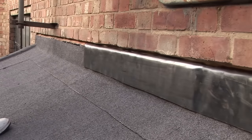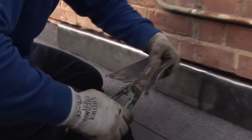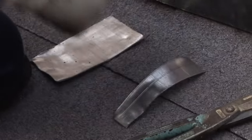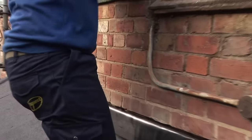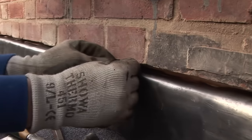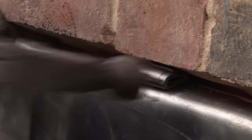I'll get a scrap piece of lead and cut an inch piece. I'll do a couple just to show you. We roll them up and they will become a lead bung. With a hammer and bolster, I'll flatten one corner so it's easier to get into the chase, and I'll push it in the wall so it stops the lead falling out. Use a hammer to push the lead bung in as far as you can — hammer and chisel to get right in there.